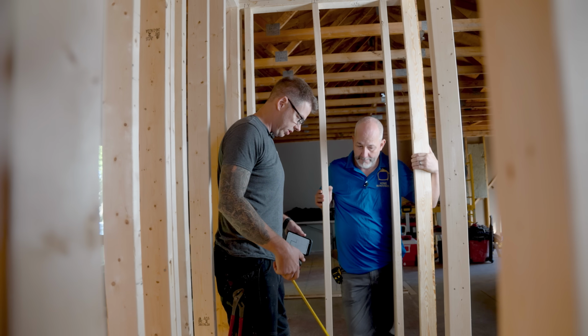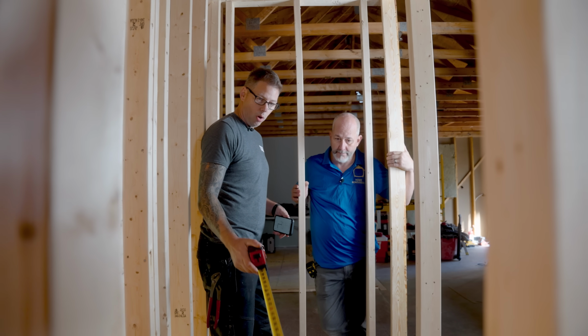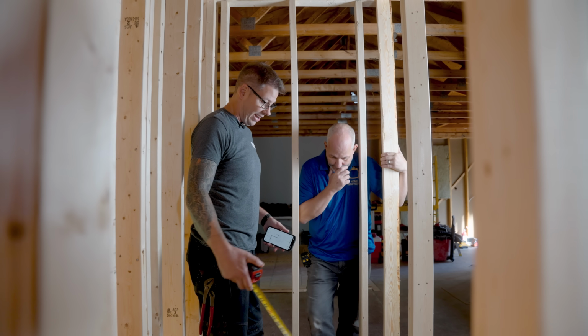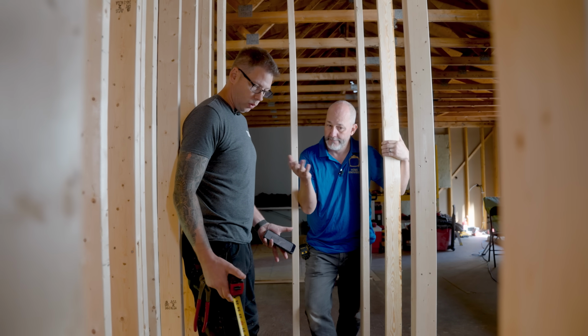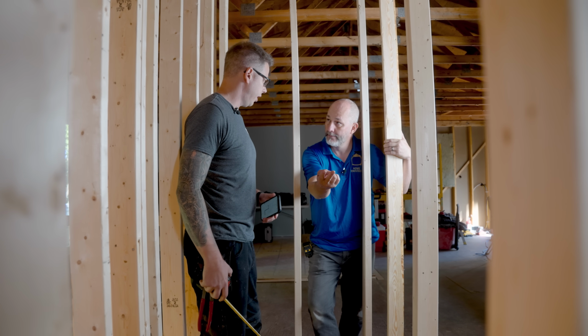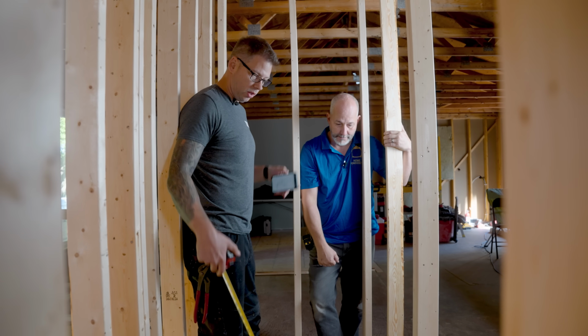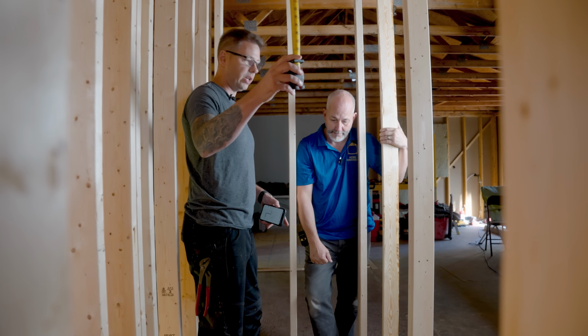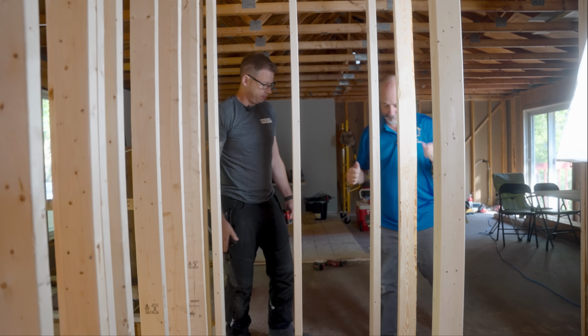Off of this toilet line, we'll pick up a sink line, and we'll bring that sink line up in the wall just here. And then that acts as the vent at the same time. So you have 2 pipes, one small going down, and you bring up a 2-inch wet vent for the sink. That vents the toilet. That's right. So all the bad stuff goes down, all the smelly stuff goes up, and it's picked up onto both fixtures and both pipes.